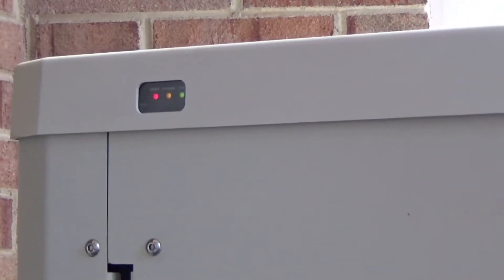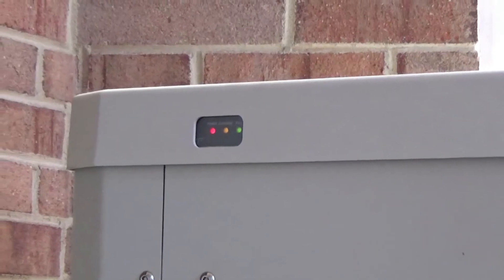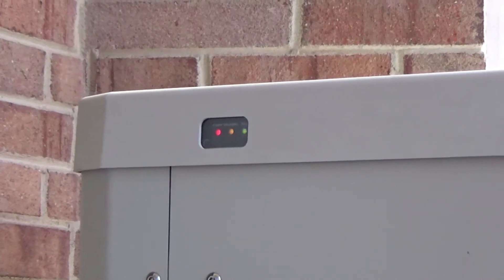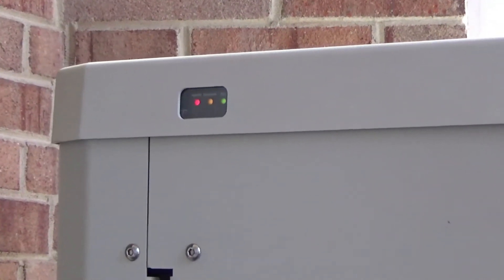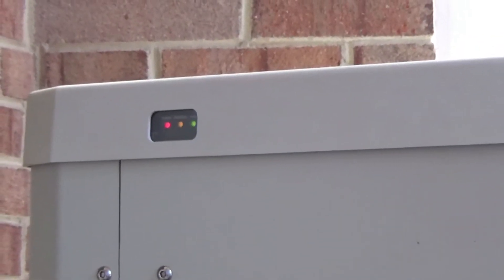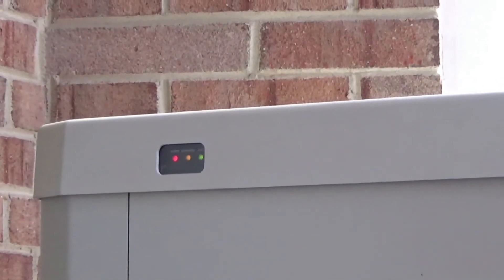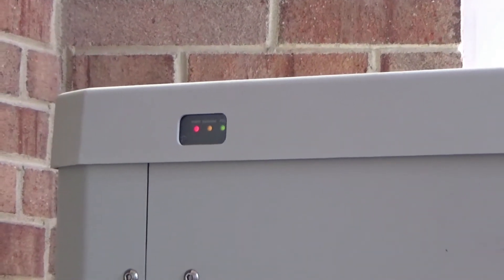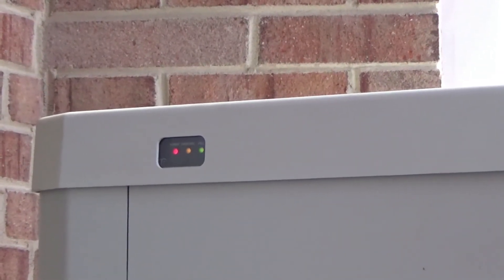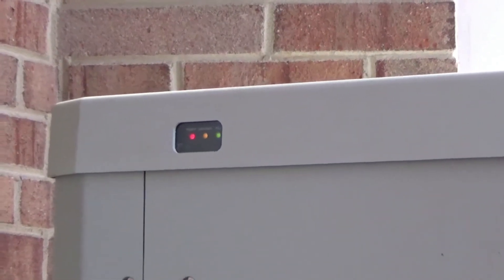The batteries are not lithium — they are regular lead-acid sealed batteries, so there are no fumes. Regarding an indication that the battery cannot charge: sometimes the light will turn green and stay green all the time no matter what you try. If that happens and the unit will not work, the batteries are probably bad. You should always see an amber light come on when you use it. These batteries should last somewhere between two and four years, though they can last much longer.